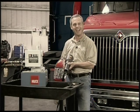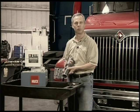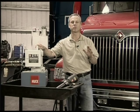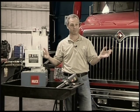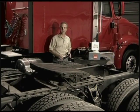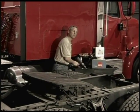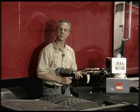The Huck 940 is recommended by International Truck for all crossmember and frame repairs for class 8 medium-duty trucks and school buses. With a Huck system, your repairs will be up to original factory specifications — forget any rework. You can use it for a variety of chassis applications.